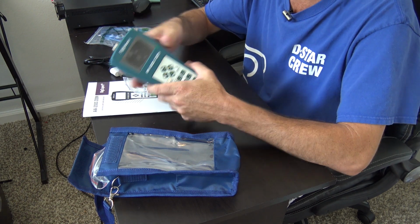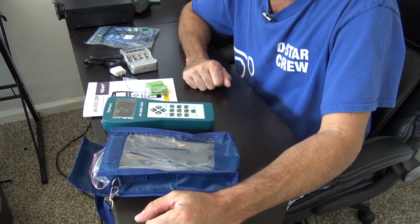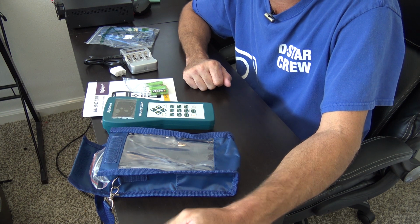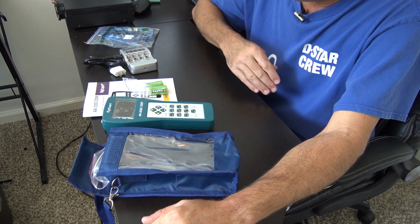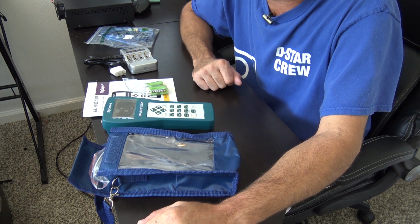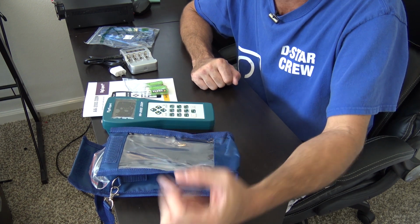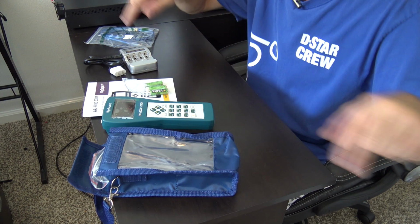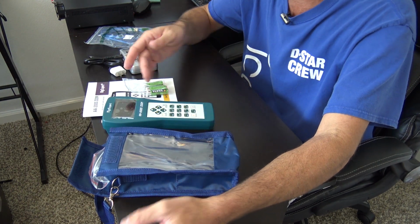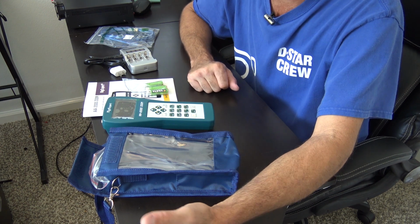That's the cool thing. I have the MFJ analyzer over there by the wall. It uses 10 batteries, and that thing would start drifting in accuracy when you have 4 or 5 batteries that are starting to go. And if you didn't put all high quality alkalines in there, and it started drifting, the rechargeables would go first. So now you have 2 batteries that are quitting, and the thing will die because you had 2 rechargeable batteries that would break the circuit in series. And although that analyzer was really good, it doesn't do nothing compared to what this does. But there's a reason that this is a little more of a higher priced item that does a lot more for those who need it, okay?